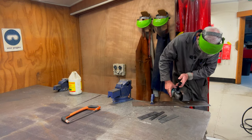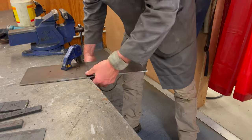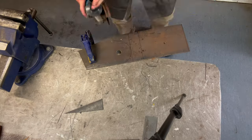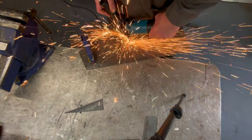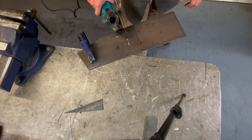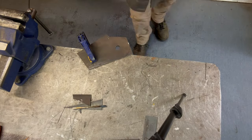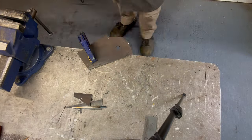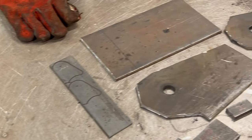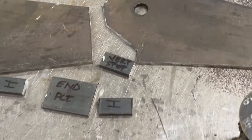Here's a quick top tip: these discs are expensive — they cost me over $5 each and I could easily chew through 5, 6, 7, or 8 of them in just this one project. The way you can make your discs last 30 to 40 times as long — you heard that right — is to take your time with the cut. Don't force the disc into the metal trying to chew into it as quickly as possible; it will lose the battle and wear down really quickly. Take your time, go slowly, and your discs will last a whole lot longer. Well, there are all the parts roughed out — and this is the very first disc. Take your time and they will last you.